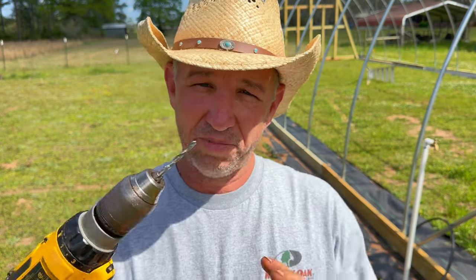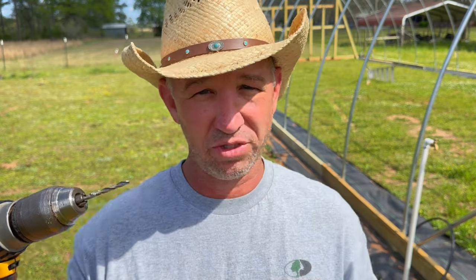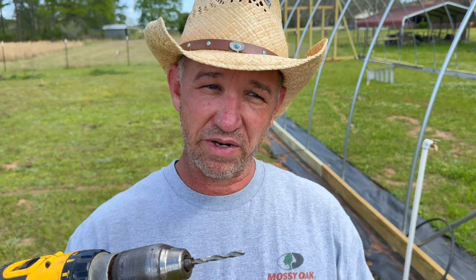Okay, although the end of that tech screw has a cutter on the end of it, it is much easier to drill the wood with a smaller wood boring bit, because this wood boring bit just drills right into it nice and easy, where I really got to get behind the tech screw and push it hard to cut the wood. Then I'm tired before I get to the metal. And then I just noticed, whenever I drilled the pilot hole, put the tech screw in, the tech screw went right into the metal. It seemed to be a much faster process. So, little tip for you.